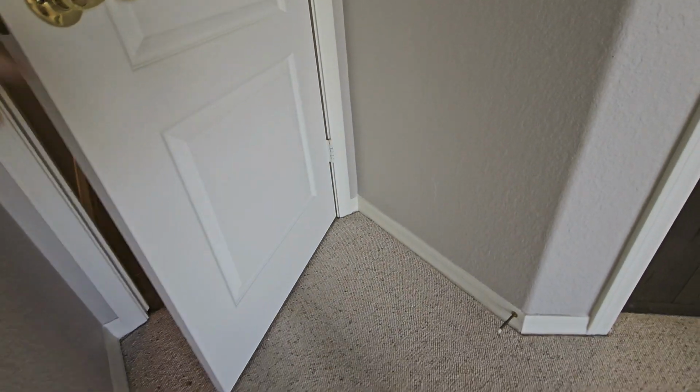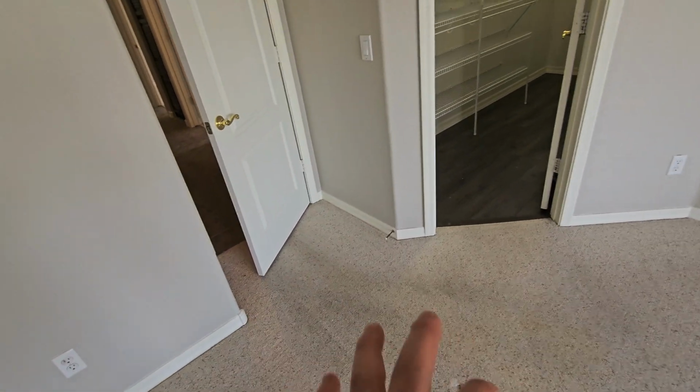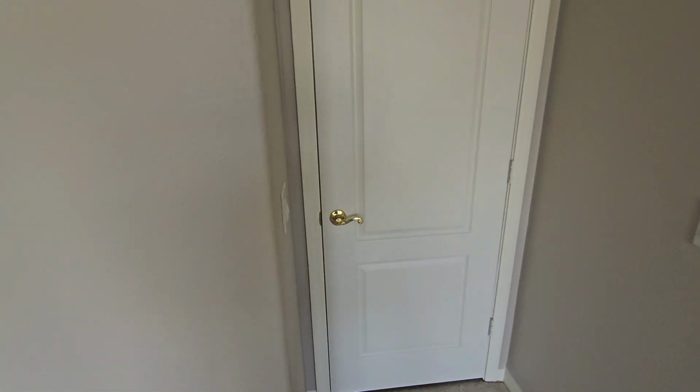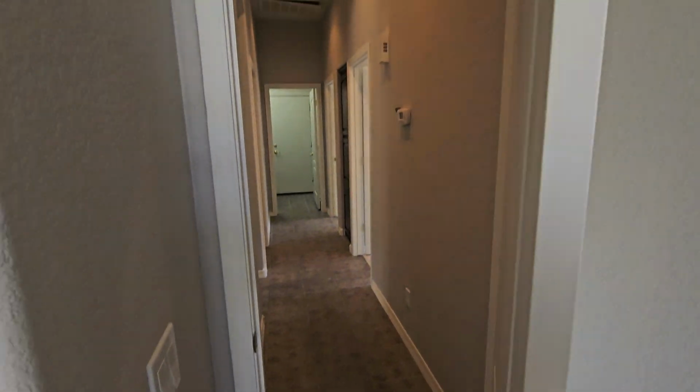So when you don't have enough adequate room for the air to get back to the air handler, you're going to create almost like a suction effect. So when this AC kicks on or the heater kicks on, the air is going to take that door and want to push it closed. See, it sucked it back in. You can almost hear it. So it's sucking air back through over to that air return back there.